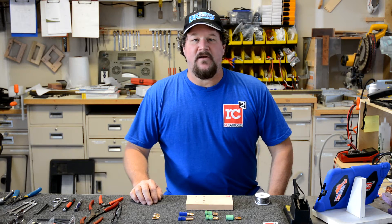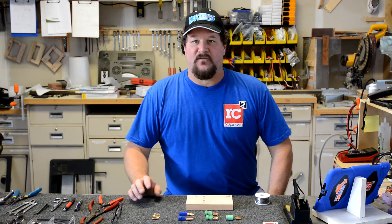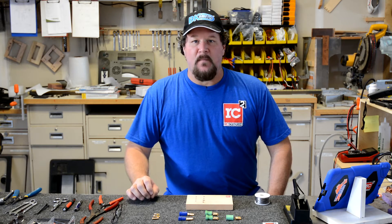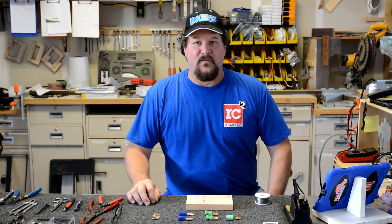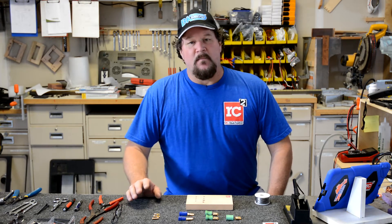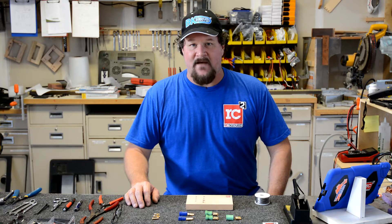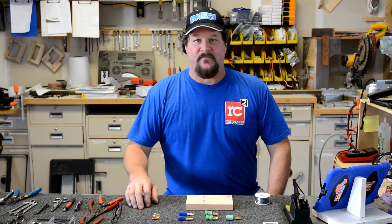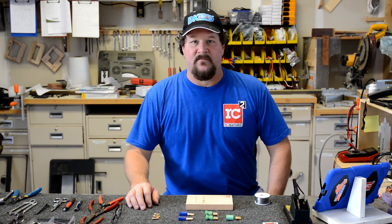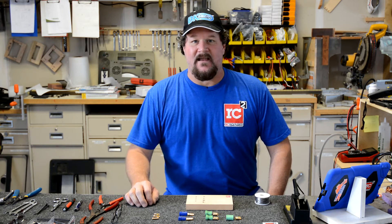We got a quick little video today — it's a how-to for soldering. A couple things that people come into our shop for week after week is to ask Kyle or I to put bullets on their motors and ESCs, and put on the castle connectors, EC5s, EC3s, and you still get Dean's questions also. Soldering techniques have changed a little bit over time because of the higher current draws we have now. The bullet connectors have gone from 3mm to 4mm to 5.5mm, and now we've got 6 and 6.5mm connectors, so you have to have the right equipment and a little more skill and technique to do the bigger products.